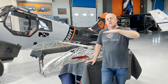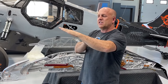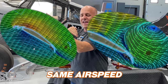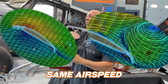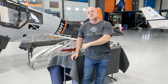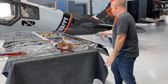But what was interesting on this one is rather than going up and having the critical angle of attack be really close to a stall, where the air detaches from the back of the wing and swirls backwards on the backside, this plane could keep going steeper and steeper and steeper. The air was so fast over the top from two slats pointed at high angle of attack to the wind, a hypervelocity increase shoved over the back, the air stayed laminar, and the curl of the air trying to go backwards lifted 14 inches away from the wing. I've never seen that on any flow analysis I have ever done. That air actually pushed a high velocity all the way over the ailerons and flaps, when every other flow analysis showed it completely detached and the air dropped back over and flowing the wrong direction up the back. This one stayed laminar all the way back.